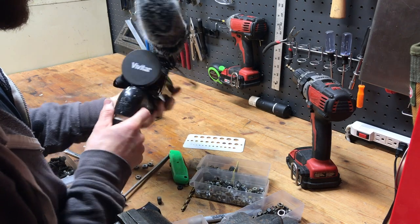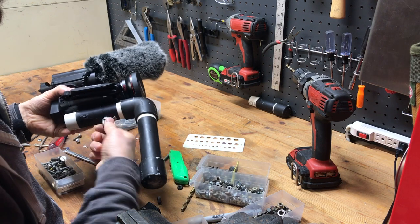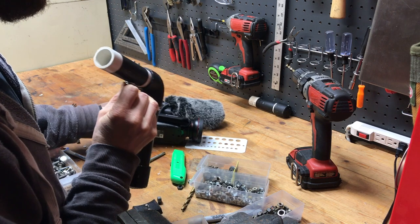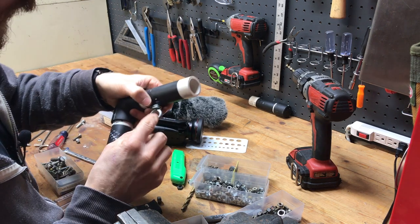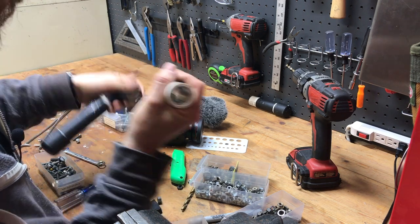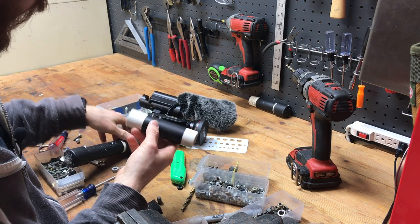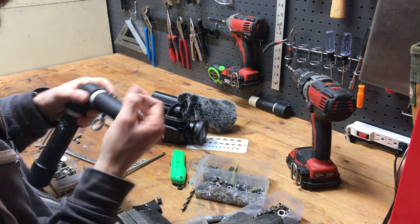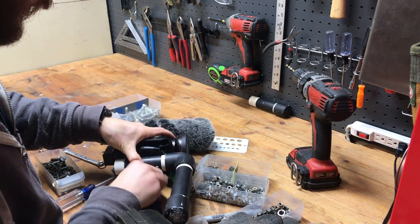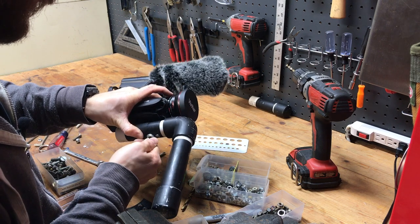After several renditions I changed some things and I think I've got it closer. I took those lock nuts out — they weren't staying in place — so I took the eye bolt and did a washer, split washer, washer, and then one lock nut to keep it from falling out when not in use. I think this is definitely on the right track — putting that in and screwing it on, that split washer gives a little bit of spring to keep it tight.